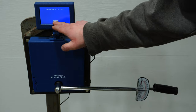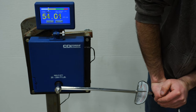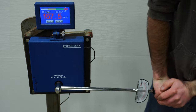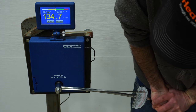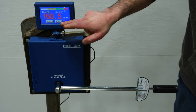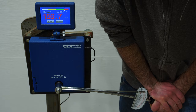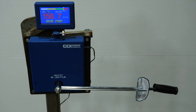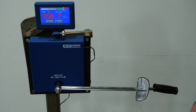Now we'll do max — 150. After running through those ranges, we're definitely over that plus or minus four percent. I'm going to go ahead and cycle this torque wrench about a thousand times, run this test again, and see how that compares. But first let's go ahead and also get the Craftsman over here and we'll see how that one compares.